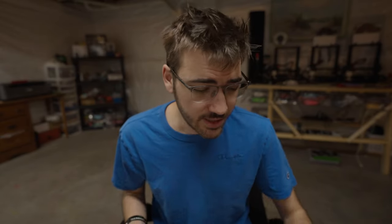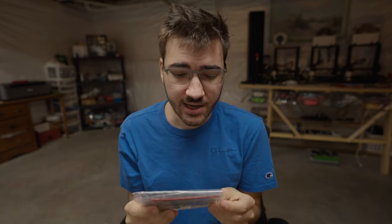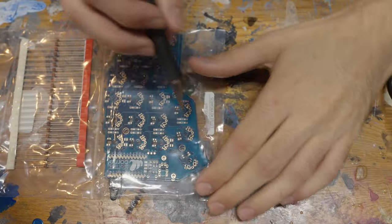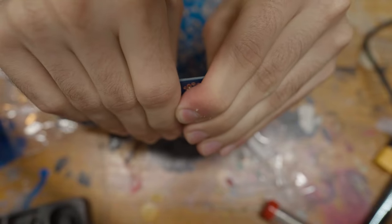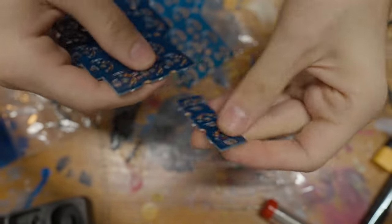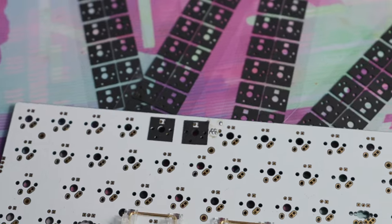I just got the PCBs in the mail — here are the Nice Nanos in electrostatic baggies. What I have to do now is make sure everything fits within the case and snap off the outer layer. I'll do that now, and hopefully everything checks out so I can start soldering. After test fitting, everything seems to fit well. I'm going to solder the Nice Nanos, get those ready to be socketed, get the diodes on, and do the switches later once I have my switch pads. I'll time-lapse the soldering.